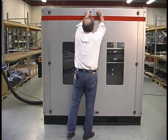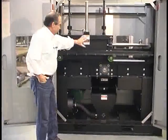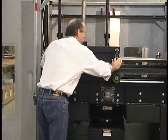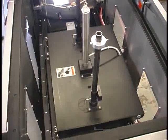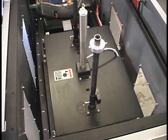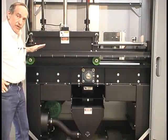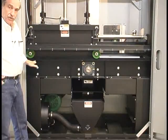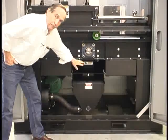Let me open the doors. What we have is a box here that we can open up and fill with purgings. We close this down. When we start the machine, this will shuttle back and forth. The box has no bottom in it — it's sitting flat on the deck, and the deck is in two different heights. On one height it drops off, the purgings drop. When it's pulled back, those purgings are driven into a high-speed planer, a set of planer blades, that take the bottom one inch right off the purgings. Those pieces are driven immediately down below through a chute to a small granulator on the bottom, which grinds them up into small parts.